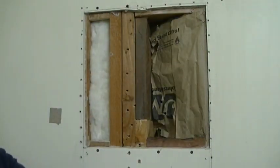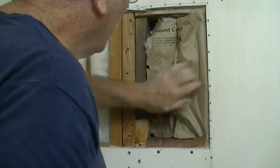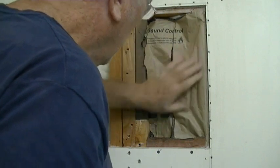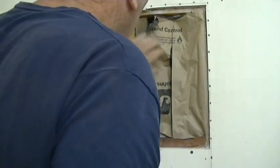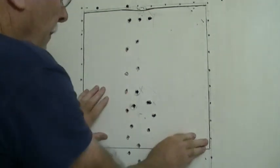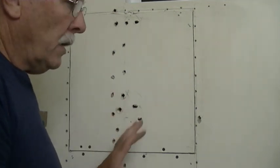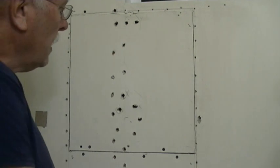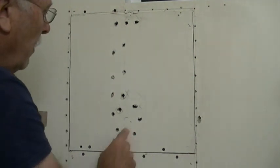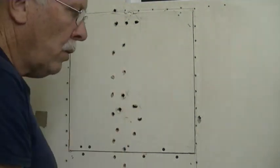Before putting the piece back in, let's go ahead and put the insulation back in place that we moved out of the way during the work. Now we're ready to put the cut-out piece back and screw it all the way around. Let me show you a trick for finding hidden screws in the sheetrock. If you had screws located on studs that you need to pull out, how do you find them? You've got to pull those out — otherwise you have broken sheetrock that you're trying to pull out.